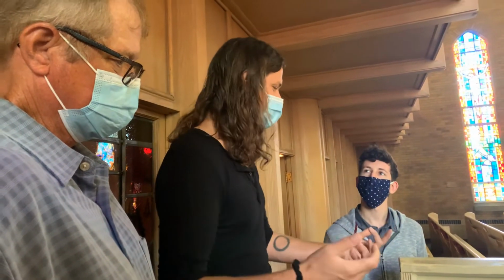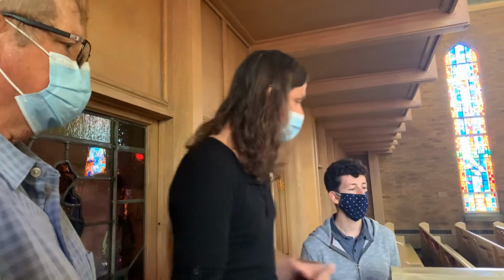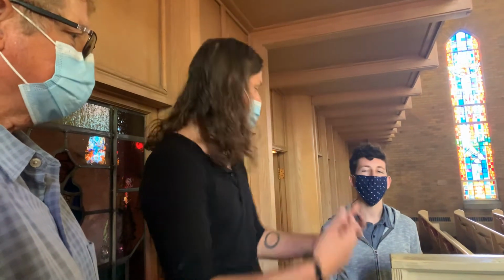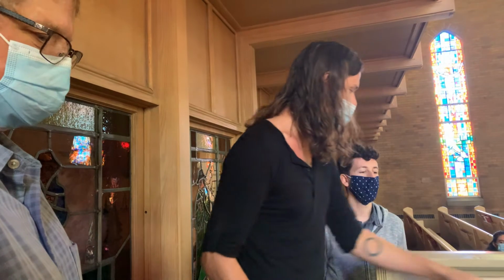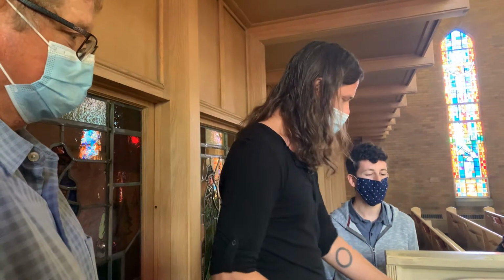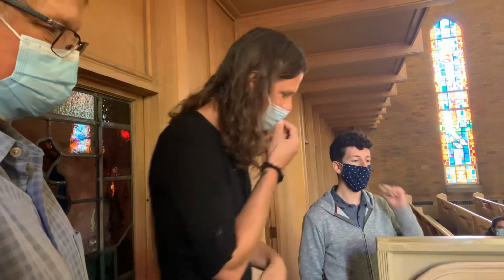Let's say this is what will inevitably get you: somebody accidentally turns the pulpit and lectern microphones off, and then you don't know about the 48 volt button, and you spend the whole time thinking that your mics are broken and that the channel's dead and that you have to replace the lines and all of this stuff, and really all it is, is this. Just one button. Yeah, you heard them pop on. Should have had that muted. And again, it won't kill anything, but over time.